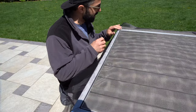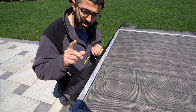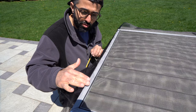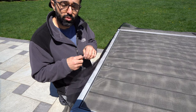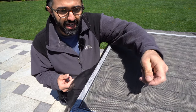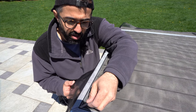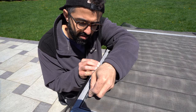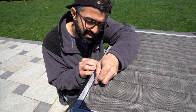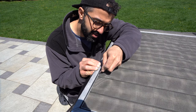The last part of the process is trimming. Don't be tempted to just go along the edge and trim like this, because two things might happen: you might not get close enough to the border, or you might actually damage the net on the inside. What you want to do is get in with the blade from the inside going outside, and cut along the edge of the spline facing away from the net that's sitting on the window. Just keep cutting until you get to the other side.